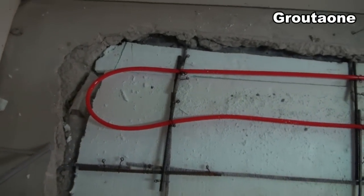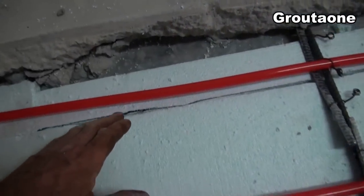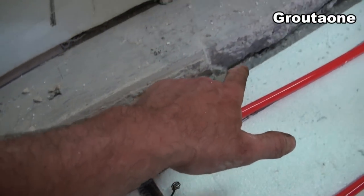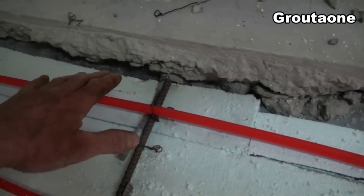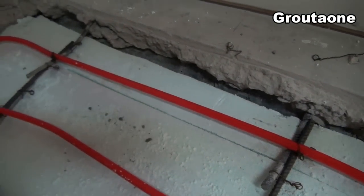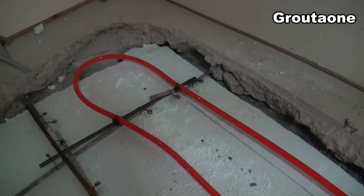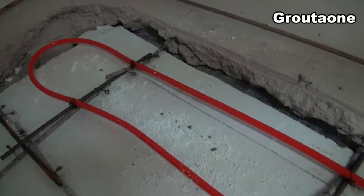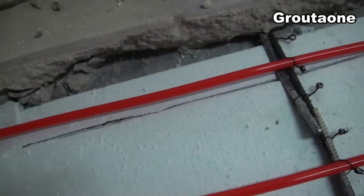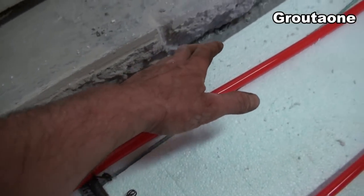So this is the first of my loops that I'm putting in here. You can see the concrete has kind of an irregular surface along the sides, and I'm kind of banking on that to help the new concrete bind to the old concrete. Because old and new concrete doesn't really want to stick together very well. You could put coatings and stuff on the old stuff to help it stick, but I'm banking on the irregular surface here where the concrete kind of gets in underneath.